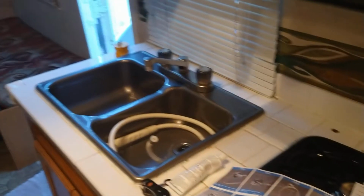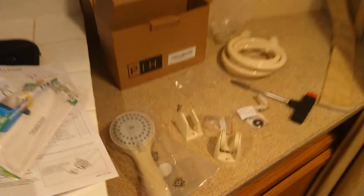You can see I actually put some on the top screw too. That way when I screw it in, it kind of seals it. I just don't want water getting in the back of this panel at all. As much as possible, try to keep everything dry. It's all fiberglass panels or something, so they're all right. But what's on the inside of this wall here, what's in the floor, you just try to keep the moisture out of everything as much as possible.